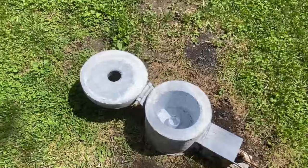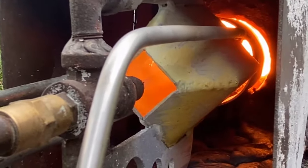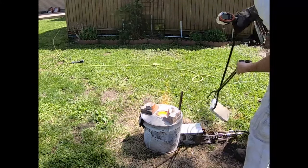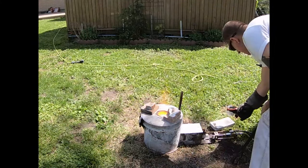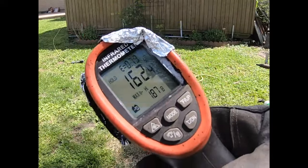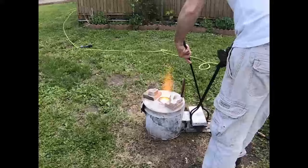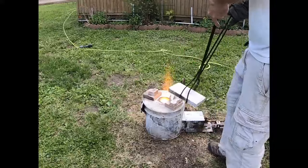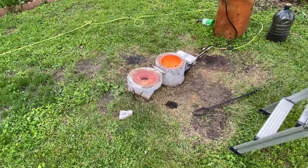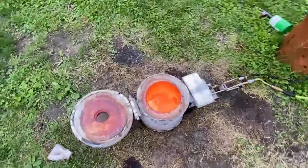Because it requires such a thin coating, it didn't paint on there very well and I feel like we melted it off. This stuff isn't made for 2,900 degrees — it's made for lower temps. This is my furnace hat idea: shooting infrared radiation back down into the furnace with an 1,800-degree emitter, rather than letting that beam of IR heat shoot right up into the sky. We want to bounce it back down. It didn't work out too well.